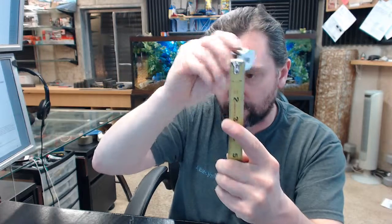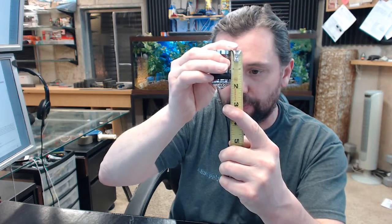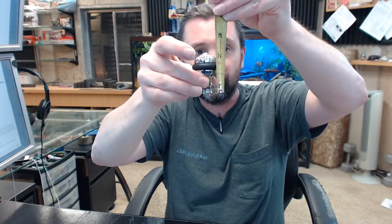Base diameter they have at 1-3/16 inches — yeah, that's correct. They have a height of 2-1/16 inches overall, that would be correct. A clearance of 1-5/16 inches, and what they are really saying is from the center line of that bumper down to the bottom, about 1-5/16 inches. So if your door is going to be in the range of a little bit heavy on a standard undercut, like a 1-inch undercut, you would still be in real good shape with that.